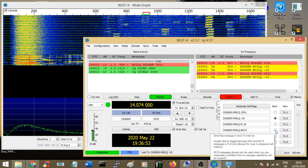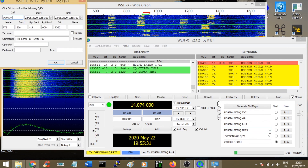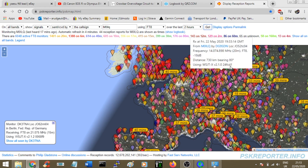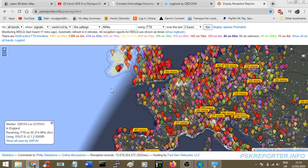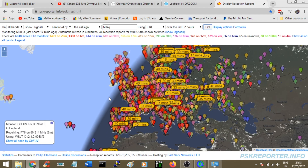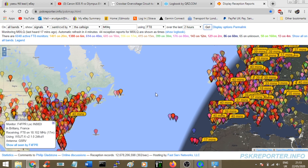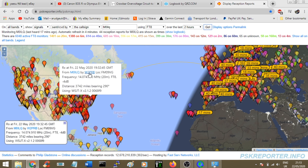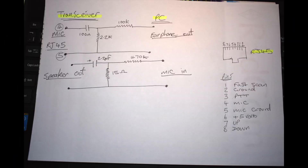I'm going to send him the 73 just to confirm the QSO, and then that's it. The log screen comes up and I log it, add a few details, click okay, and then that's in the log. If we go to PSK Reporter - pskr.info - you put in your call sign, your mode, last two hours up to last 12 hours. As you can see on screen, about 39 minutes ago is when I started. I had a contact with DG9SDN over there in Germany. Zooming out you can see where you've picked up signals from other stations - there's one over there in Berkeley Springs in America on the East Coast.